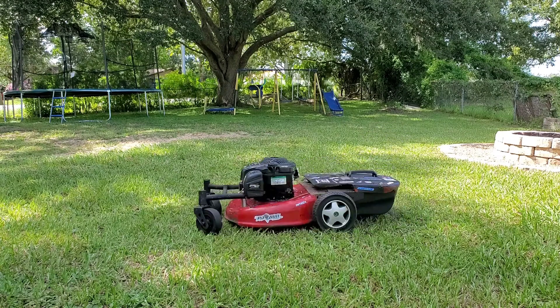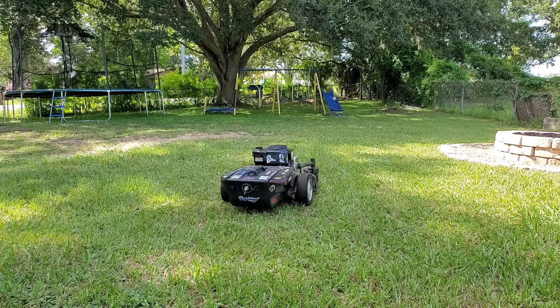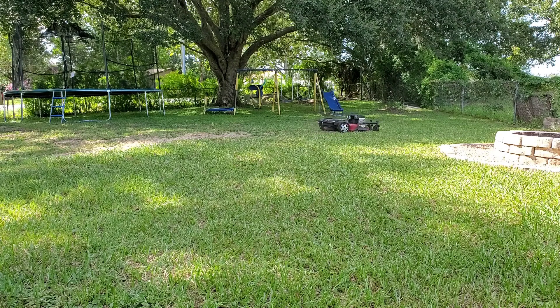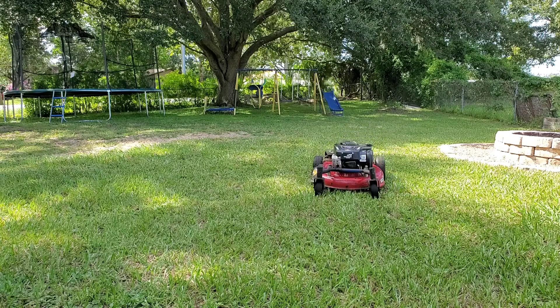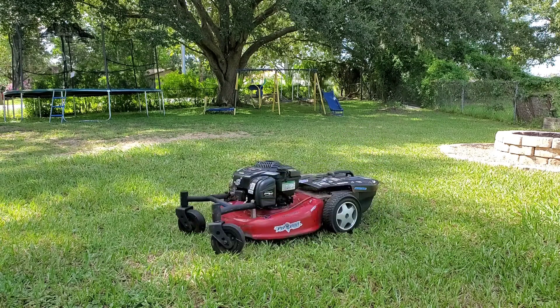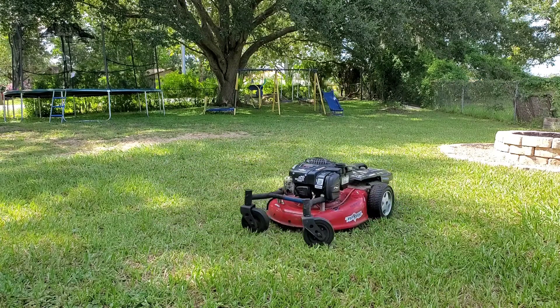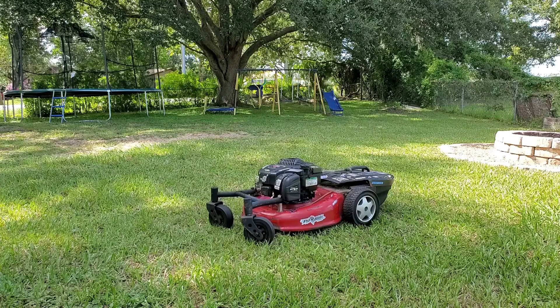If you have any questions, let me know. I hope this gives a pretty good breakdown of the mower itself. I wouldn't go the route of trying to find a wheelchair — I would suggest going on eBay and trying to find motor gearboxes. They're like 50 to 70 bucks for a pair, and you can just buy those and not have to deal with the wheelchair. What was nice with the wheelchair is I used a lot of the framing for some of the metal that I needed.